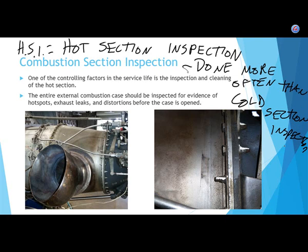In the United States, one way to move gas through pipelines is to have giant turboshaft engines. And when I say giant, I'm talking about an intake that's 5 feet in diameter. It's like a 747 engine, except it doesn't have a fan. It drives a shaft, and that shaft spins a natural gas pump, and they will run those engines off of the natural gas pipeline that it's pumping. They will have three engines, and they will run two of them. And they'll have one shut down for maintenance, ready as a hot spare.